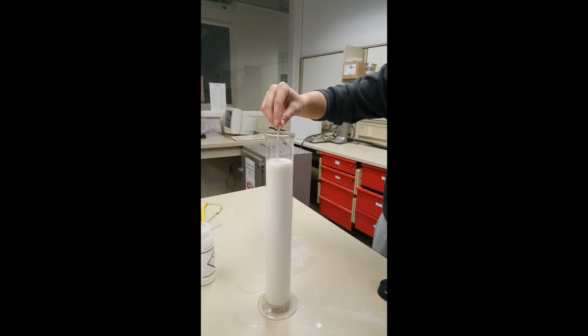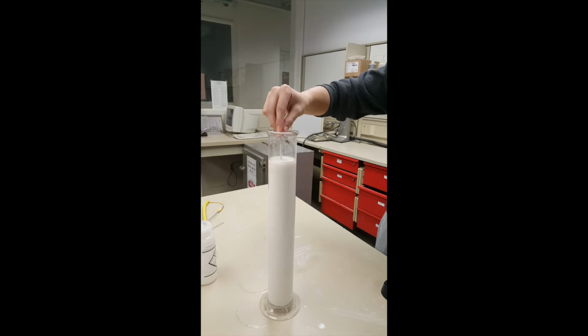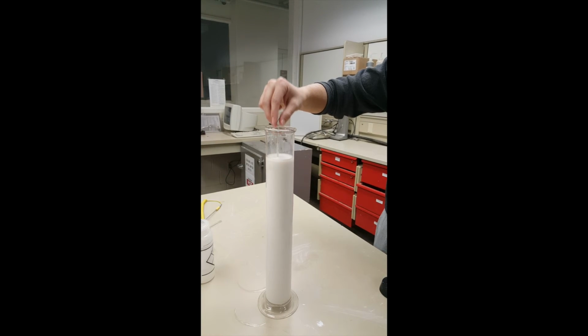Remove the hydrometer from the soil solution after the 5-minute reading and place it in the box when it is not being used. Record the hydrometer reading and the temperature from the calibration cylinder. Leave the hydrometer in the solution.